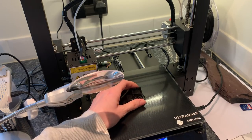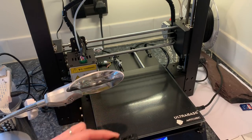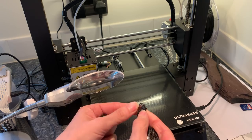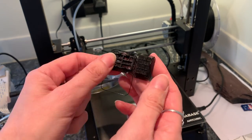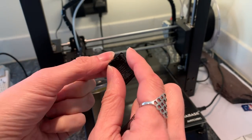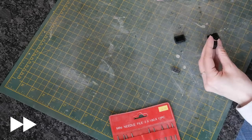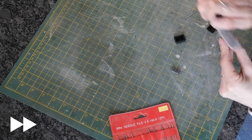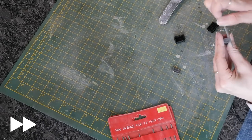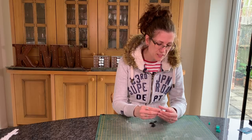An hour later and we're finished. You can just pop these off — especially if it's a little cooler; this is still slightly warm. You can see the brim all around the edge. It's very easy to pop off, and on these ones it hadn't stuck particularly well so it was easy to pull off. There's the prints as they come out — this one's got a lot of support on it. Next comes a really tedious part of having a 3D printer: either filing or filling. You can fill all those layers or file them away flat, but either way you have to do quite a bit of work to get the edges to look good.